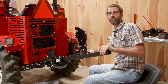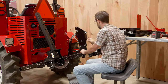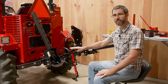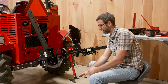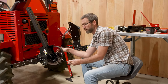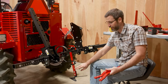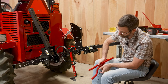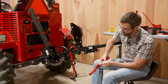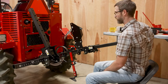We're going to put the second trailing mount on, and then jump to putting the A-blades with the torsion mounts on. We're going to put the A-blades on with their flex mount. The A-blades come in four to ten inch sizes and you want to get within about a couple inches of the row. We typically sell the A-blades with a standard flat shank going vertically, but we also have two different ones that give a little more offset if you want to go around an obstacle. Keep that in mind as we're building and designing these tools.